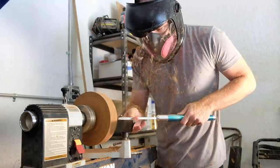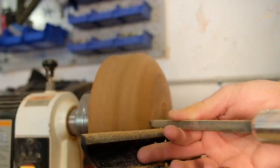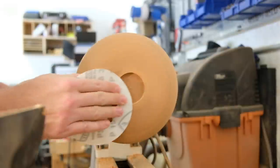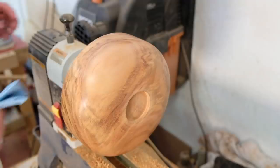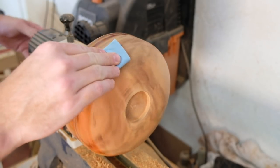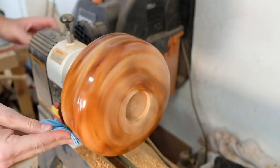Nonetheless it was a useful project and has been a great little stand for my lathe, jointer, and bandsaw over the years. I used the square roughing tool to cut a mortise or recess that the chuck can hold on to when I hollow the inside. After a little bit more shaping I moved to sanding. I had a pretty decent tool finish on the outside of this bowl so I started at 150 grit and worked up to 320. I added a coat of walnut oil and the figure in this wood just came to life.